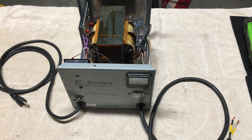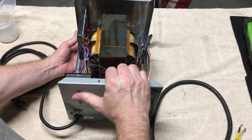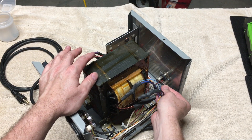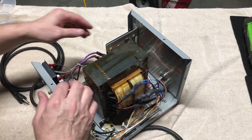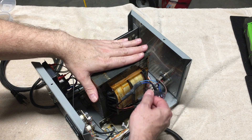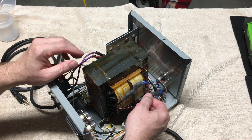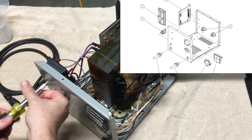Setting the cover to the side, when we look inside the charger we do see some SCRs in the back. The terminals — at least the anode and cathode — are soldered on, while the gate uses a push-on female terminal. The transformer connections don't look bad or corroded; rocking them back and forth they don't feel loose, and there's no sign of overheating. I'm going to take the boards off for a closer look.